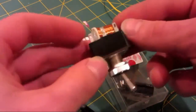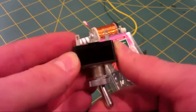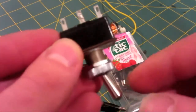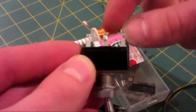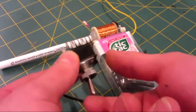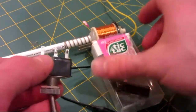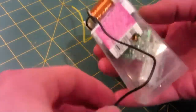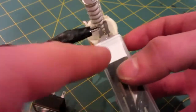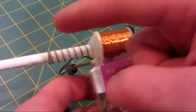For the wiring, I'm going to be using this three-prong two-way switch. I don't remember the exact terminology, but this is the type I'll be using today because it's the perfect size to be a trigger for my gun. Essentially, how they work is when this is in the right position, these two prongs are connected, and when it's the other way, these two prongs are connected. What I want to happen is, as a regular gun would, when you flip it backwards, these two prongs provide power to the coil. There are two wires coming off of the capacitor — the first wire you can just send to one of the terminals on the coil. If you put it to the wrong one, the coil will just shoot the projectile backwards, so you'll have to switch it to the other one so it comes up the barrel.